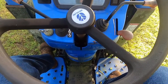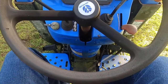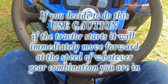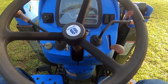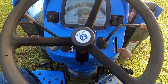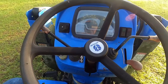That is how it freed up for me, and hopefully it works for you. The other option, if you cannot get into any gear combination — and I struggled quite some time going through different combinations — is to bypass the electromechanical safety feature so you can start the tractor in gear. I didn't have to do that; stubbornness finally got the tractor into gear. Anyway, I hope this helps. Drive it at low speed for about 40 minutes — maybe half a mile to a mile — make sure nothing's in front of you, make sure you've got enough gas, and that flywheel and clutch plate should free up. Leave a comment.